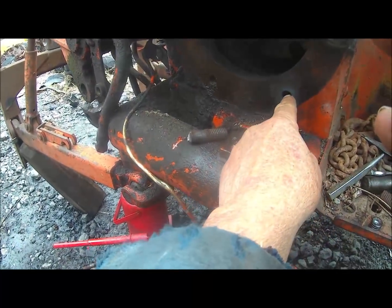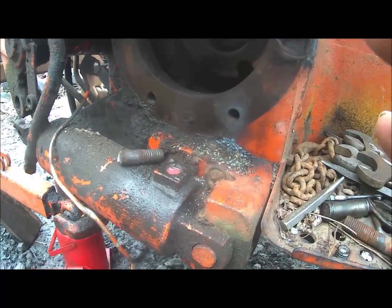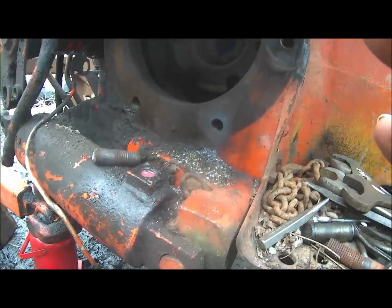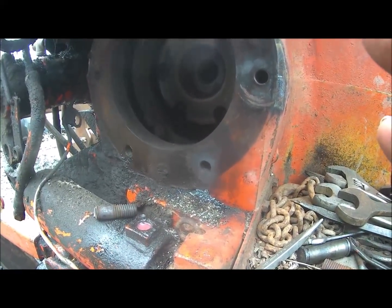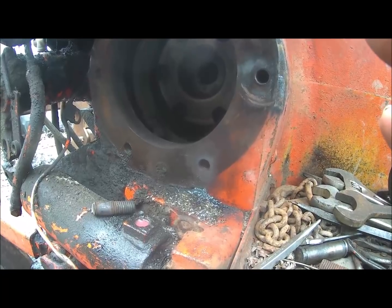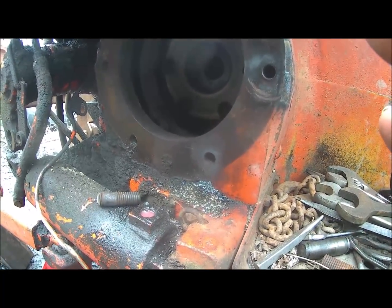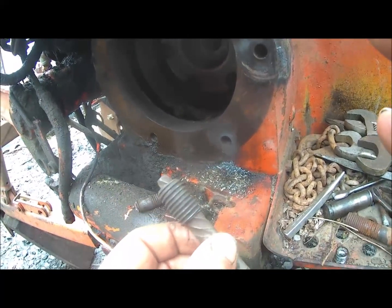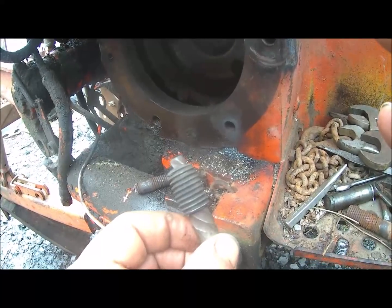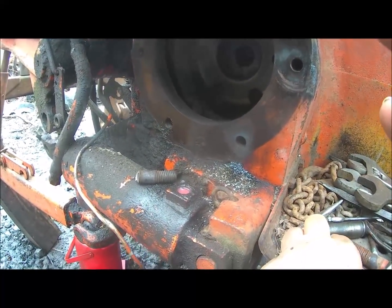And this one we had drilled out, and it wouldn't work. So it had a 1/2 inch hole in the center of it, and I took a heating torch, warmed it all up real good, let it cool off and everything. Then we put an easy out in it, and it grunted real hard, but it finally come out. So them two was done.